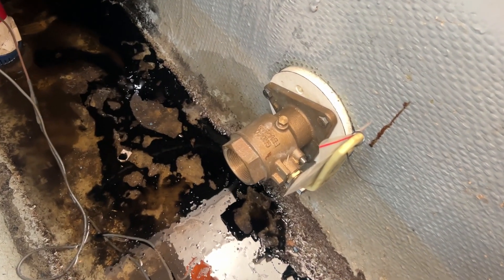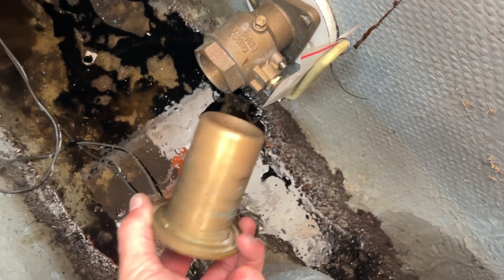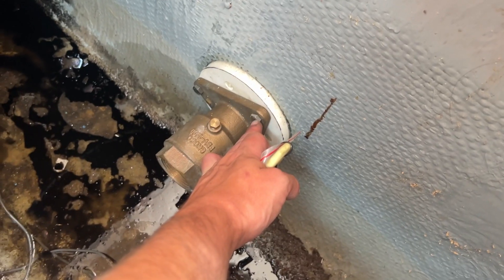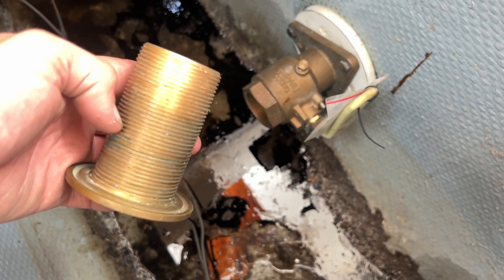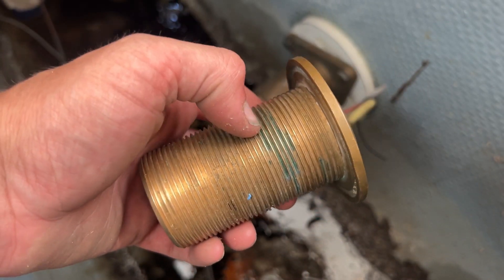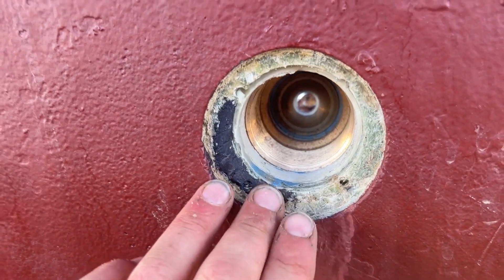What's up Vanda crew — we are back with our through hull installation! It's the next day, so let's take a look. Everything should be bonded correctly. Here is our backing plate, and you can see I've already test-fitted the seacock to it. This is our through hull — I took it out and test fit it so it's not all the way on, but you can see how the bolts hold it in. Next I'm going to test fit this and see how much we need to trim off. I'm gonna go on the outside of the boat and screw this into the seacock until it won't go further, mark how many threads remain, and then we'll know how much to cut off with the cutoff wheel.